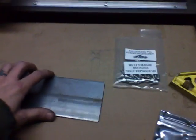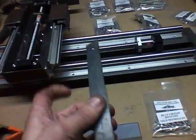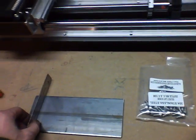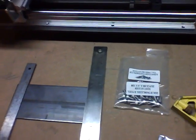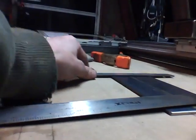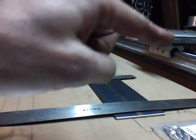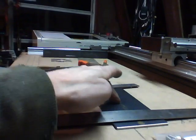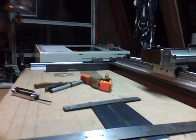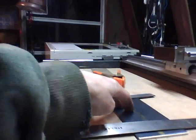What you do is — if this was your countertop in miniature — you take two very straight parallel sticks; sometimes they're different woods, different colors, sometimes there's even a hole in them. You place a stick up on edge at both ends, so you have a stick there and a stick here, both on edge. This allows you to squat down and sight the edges of the sticks. Because they're longer and straight with a clean edge, they pronounce and multiply any irregularities in your countertop — you can tell even a small discrepancy at the far end of the sticks.